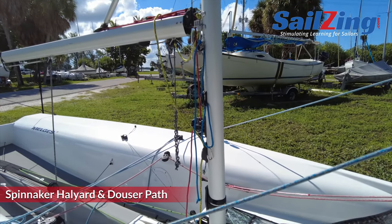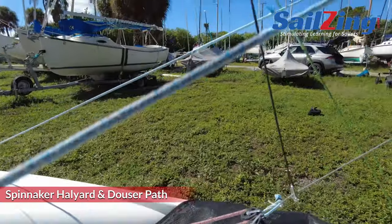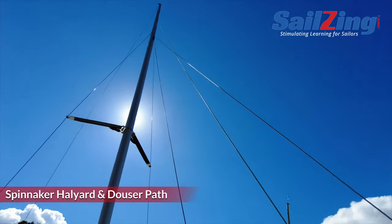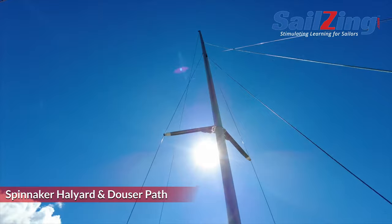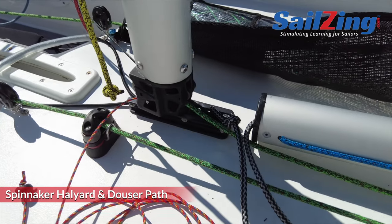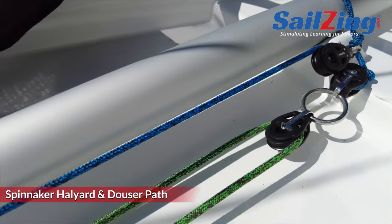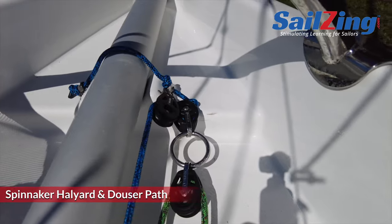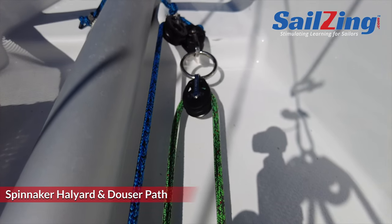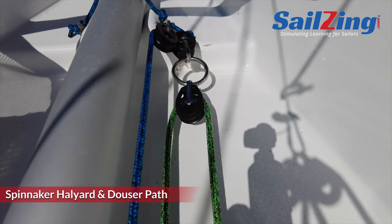Follow the path of the spinnaker halyard. In my case, this is the green line, and it goes all the way up to the highest forward exit on the mast, comes out of the bottom of the mast right here. You see the green coming out, and then follow it forward up along the sprit, and it comes up to this little assembly. So you have a block, and you want the spinnaker line to come from the mast to the inside of that rear block and to the outside, to the starboard edge of the block, and then back to the stern.